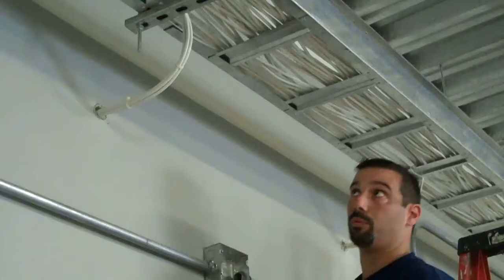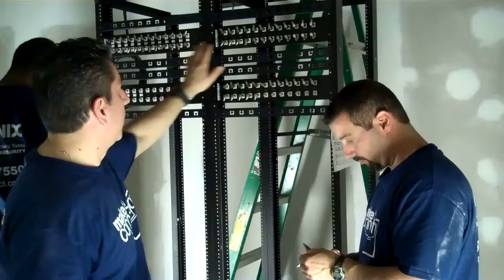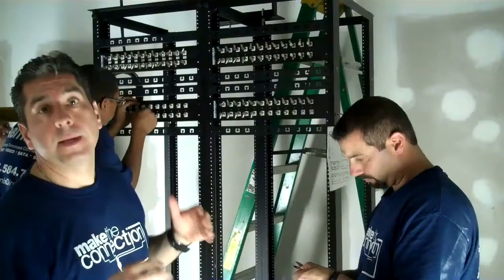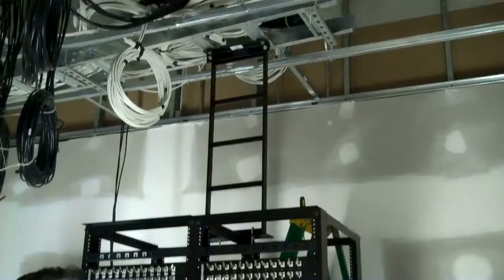We're working on the head end now. We've got approximately 90-something coaxial cables, all quad shield — we happen to use Coleman cable, well-made quad shield. Now we're putting out the patch panels and making the actual groupings. It's very important to keep it maintained, organized, and labeled correctly — it'll make our life much easier later along the line. We're going to start dropping all the coaxes down our ladder rack, splitting them to the sides and some in the center for a nice neat distribution.